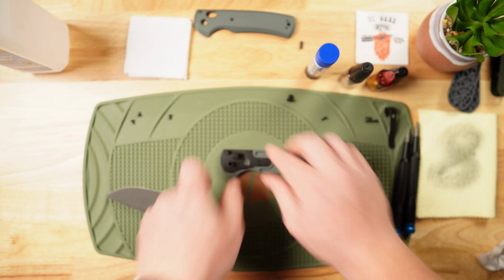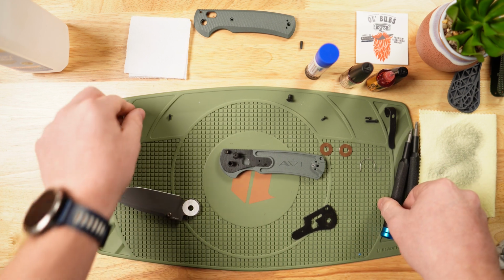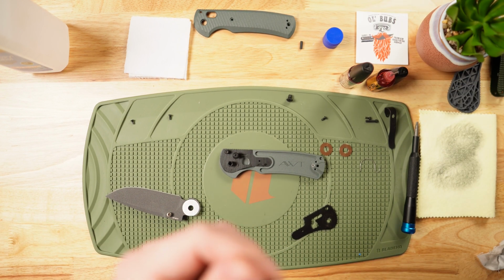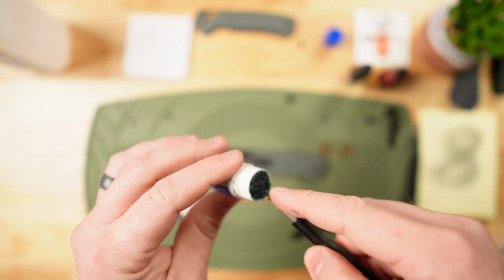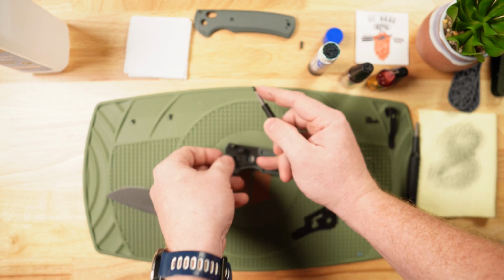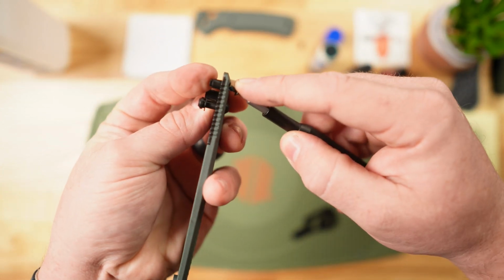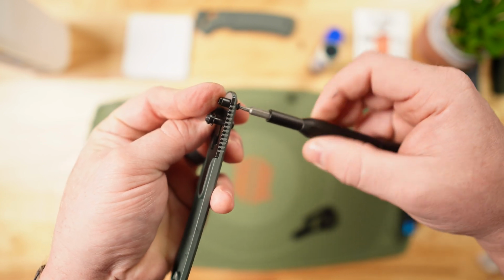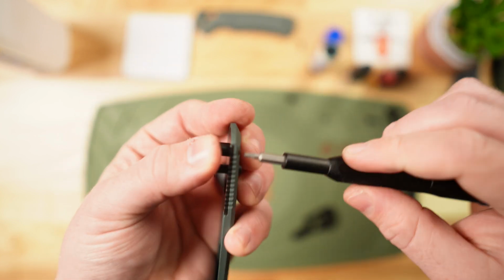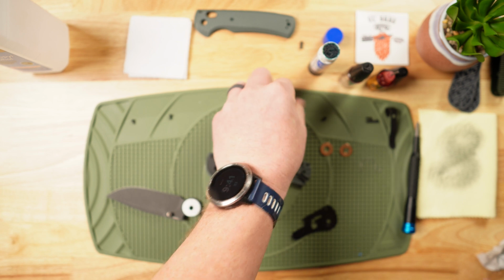And then what we're going to do from there is just put in a screw and a screw here to keep that in order. So we'll take our little Loctite on a stick here, grab a little bit of thread locker on each of these screws, pick this up with our pivot here, and just secure the stop pin. And right now we're not going to make anything tight. We're just going to get everything into place, and we'll go around and tighten everything at the end.